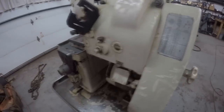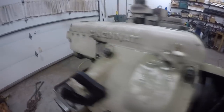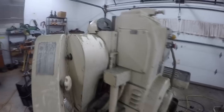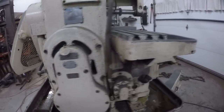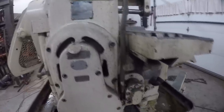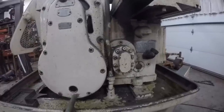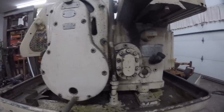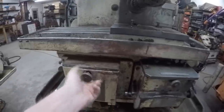At the back you can see this motor drives the spindle through a stepped V-belt arrangement. You can either drive the spindle directly or it also has back gears you can shift into for extra gear reduction. There's another motor tucked away behind this housing on this side which powers the table - there is a mechanical linkage which drives a lead screw like you would find on virtually any other milling machine.